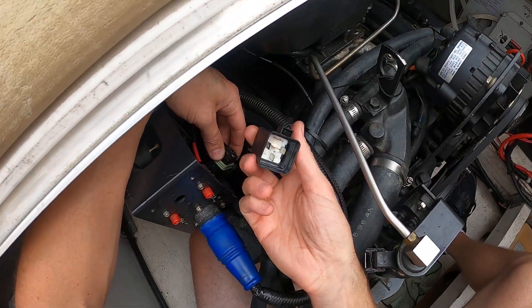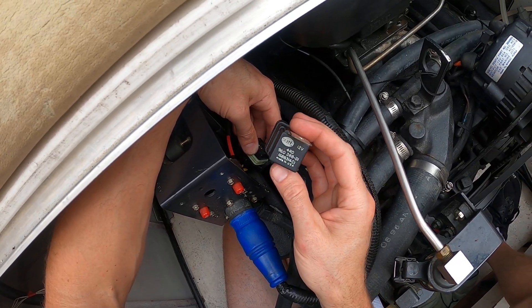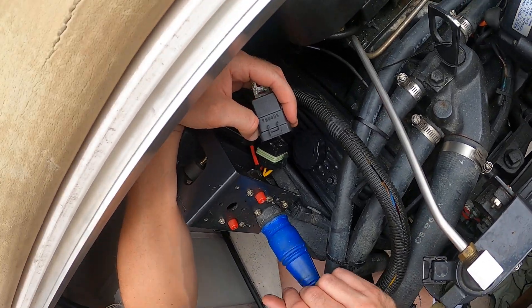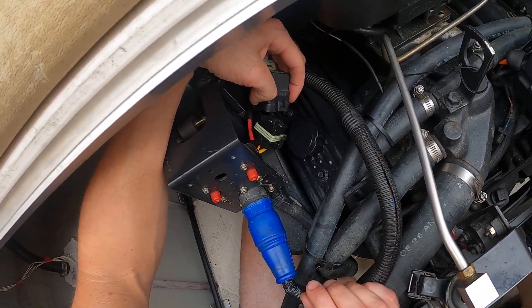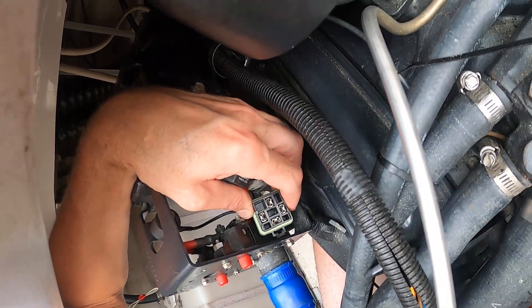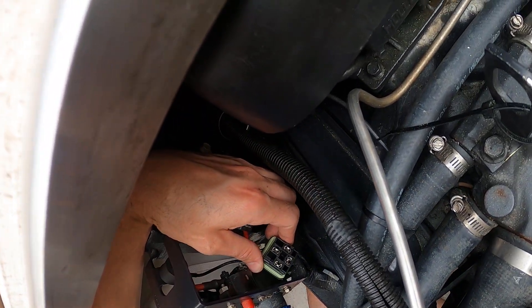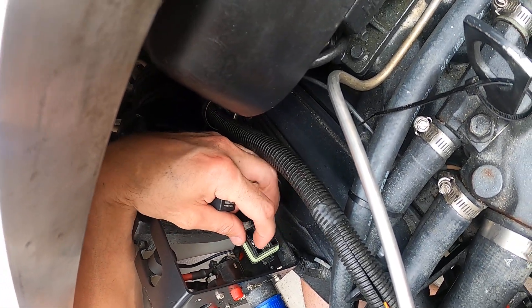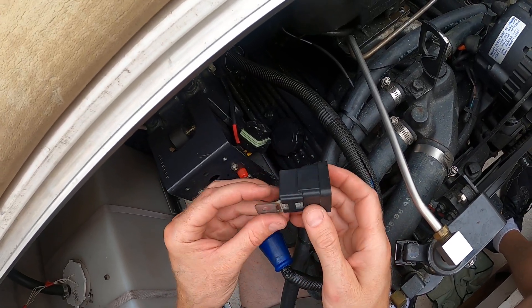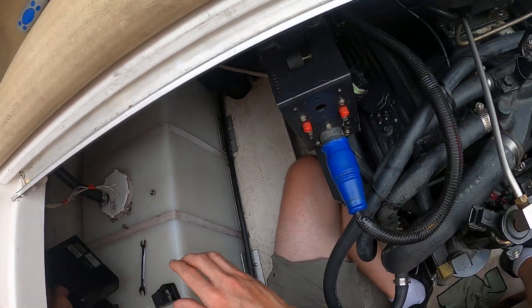I went to the bench and manually made all my connections, and that ended up pulling in the relay on the bench — I had zero ohms when the contact closes. Since then, all I've done is plug everything back in and now it is working. I'm a little suspect about this relay. I'm going to take a further inspection and make sure nothing is arced or bad with the actual connections on the plug. I didn't see any pitting or arcing on any of the contacts, but I'm probably just going to buy an extra relay just to have it on hand.